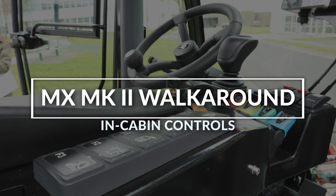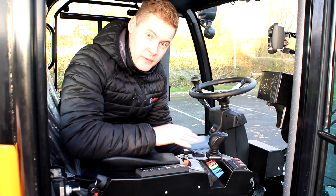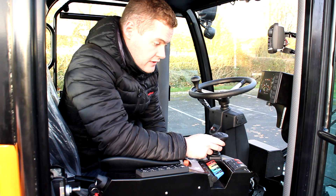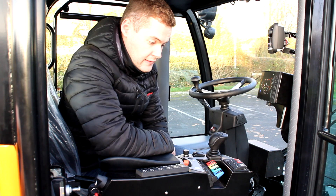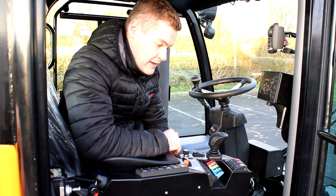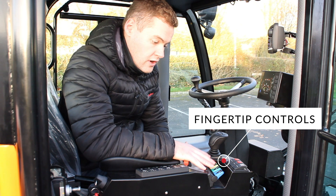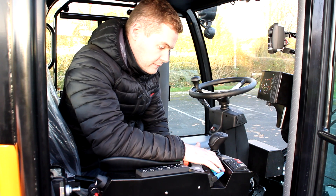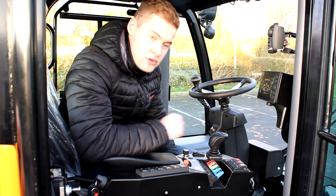Taking a look at the control console — the whole console is connected directly to the air ride seat so it moves up and down with the seat, keeping your arm steady. It's all fingertip controls: first you have your mini joystick controlling your front hitch lift and tilt, with forward, back, left, and right. Then you have the finger paddles — a whole new control system — where each paddle controls a function. All controls are fully proportional with float, where you simply push down to lock into float, making even larger heavy attachments like a boom arm simple to use with fine, precise control.